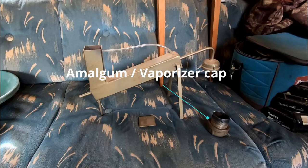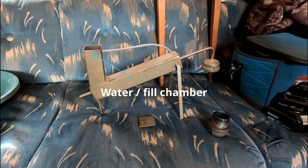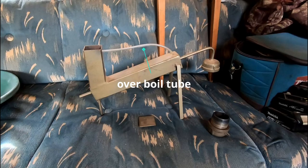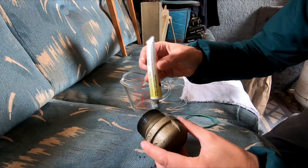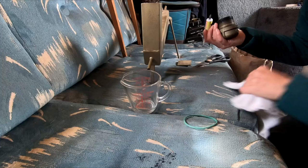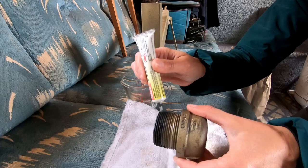This is the amalgam vaporizer cap that we will heat up to vaporize the mercury. This is a condensing tube. Keep in mind that mercury's boiling point is 675 degrees. Above that, it starts to vaporize. With temperatures like that, the chamber must be water-cooled. This is one reason why we're using antifreeze and water to fill up the water-filled chamber. The extremely hot mercury vapors will cool down as they go to the discharge tube and eventually tumble down into the Pyrex cup. And just in case we heat things up too much, we have the boil-over tube, much like a car radiator.